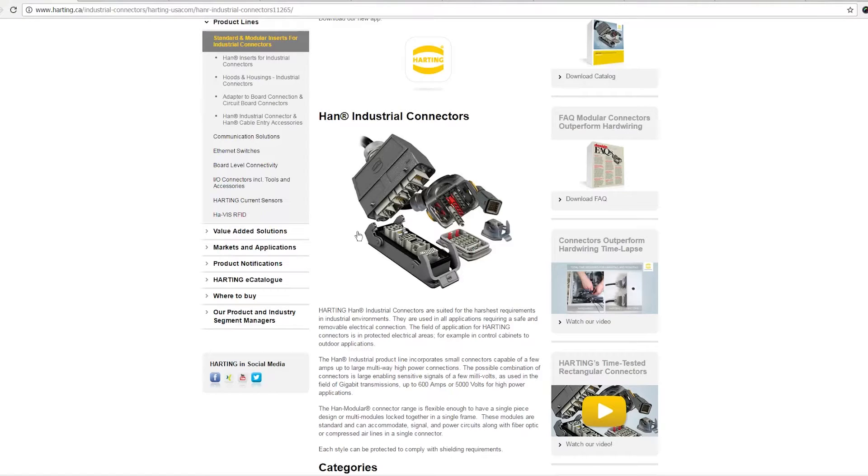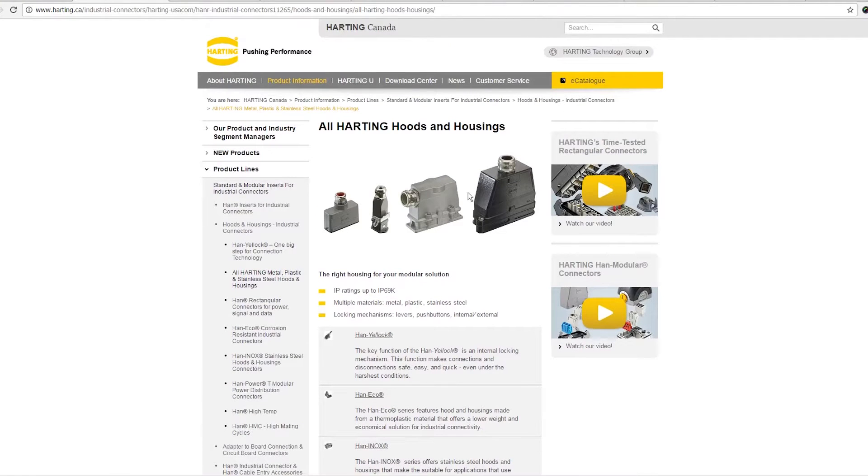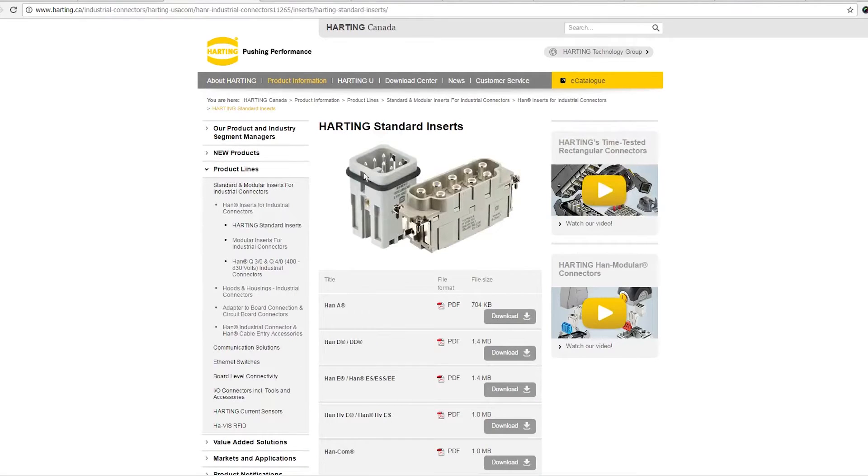It also means you can customize what you want. Over time, Harting diversified their product line. In general, you have metal housings that lock, have waterproof cable glands, O-rings, etc. They're generally IP 60-something or higher. You have the inserts, which are the actual contacts and terminals. They range from the bare basics of a couple pins up to 10 amps, to very exotic ones that are 100 or 200 amps when you need to pass a lot of power through. They can be crimped or screw terminal.